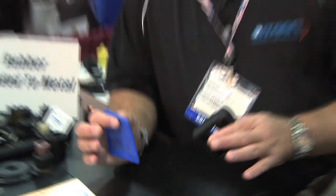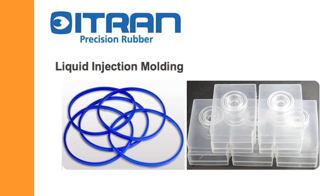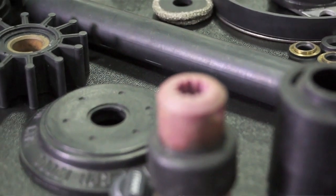This has really opened up the medical device industry for us at ITRAN. With liquid injection molding, you can run hotter because you can inject faster at lower pressure, and generally you're in the 30-second range. So you don't need to build a 25-cavity mold — you can build a 4-cavity mold and have the same amount of production. Tooling is cheaper. It's actually more precise because you run flash free, and you don't have to put parts in a cryogenic deflashing machine, which is a nitrogen cost. It comes off the machine, it can go in the bag, it can be AQL'd and out the door. There's your cost savings.